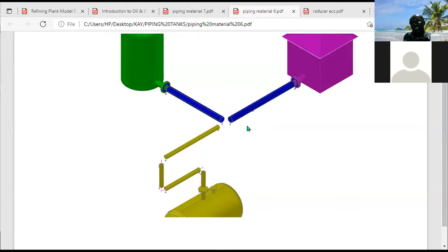If not, you won't be able to achieve that. If you just merge these pipes together, then a lot of water is going to flow out. You lose a lot of fluid, a lot of liquid from the larger one. Not everything is going to enter into the smaller one. So you need that fitting, called a reducer. It can be concentric, it can be eccentric.